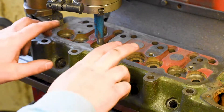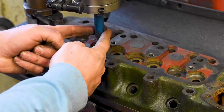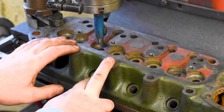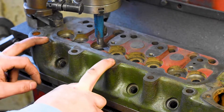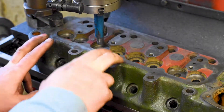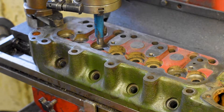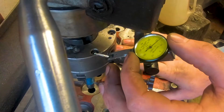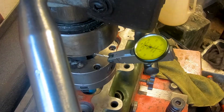We're now moving on to the process of how we're going to set these seat heights accurately. What we have now is a cutter installed in the milling head. This is a homemade cutter I made myself — a bit of tooling I made up many years ago for cutting these valve spring seats. Maybe that's another video down the road. It's just a mild steel rod with a pilot turned on the end and a piece of high speed steel machined to give the right geometry for this valve seat. I have a dial indicator gauge set up, and when I bring down the cutter until it comes in contact with the valve seat, the dial indicator gauge reads zero.